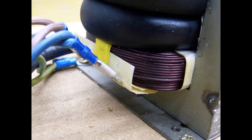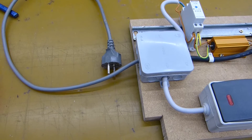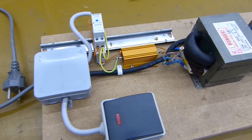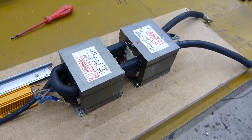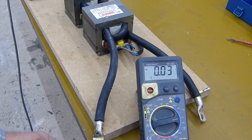Here you can see the wiring of the primary coil. As we are using two transformers, I wired them in parallel. On the first test — oops — the main fuse went off because the transformer, just by switching it on, went into saturation and drew a lot of power at the initial switch-on. So I decided to build in a resistor of 47 ohms for the first 0.1 second to limit the inrush current, and after 0.1 second a relay switches in full power. Since then I haven't had a problem with blowing the main fuse.